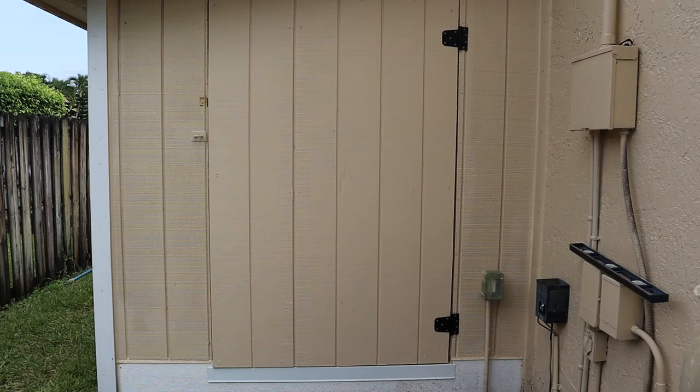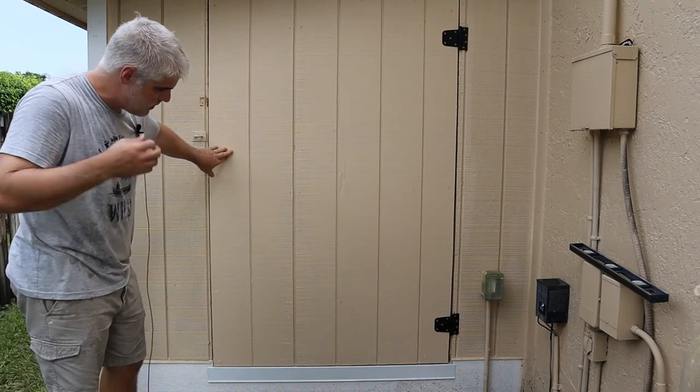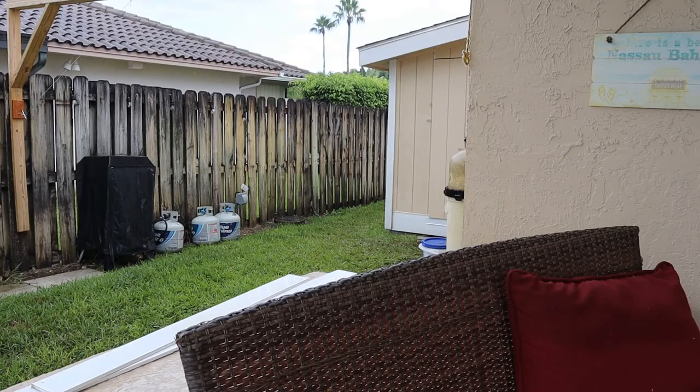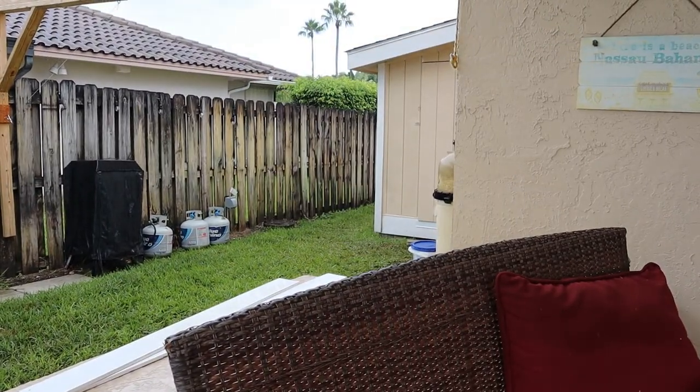I made a mistake — there's not enough clearance on this side of the door to fit the door seal. There's maybe just under a quarter of an inch of clearance and I can't really get any more because of the way the frame is built. I could take the door off and plane it, which is probably what you should do if you're doing this project, but I'm not going to go that crazy. I've been at this a while and I got five or six years out of the first door, and hopefully with all the paint, primer, and caulking on this door I'll get twice that. I'll install that third door hinge instead. And it's raining again — can't catch a break with this weather.